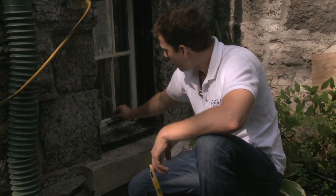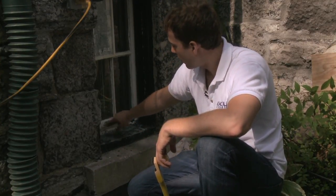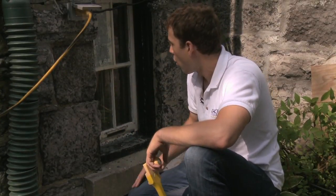The first thing you're going to want to do is take your scraper and scrape away all of the loose and failing paint. Following this, we're going to sand the edges smooth using our electric sanding equipment. We're then going to use a caulking gun and some caulking to seal all the cracks and loose joints. Any loose joints or cracking putty in between the window and the window pane we're going to fill with what's called window putty — it's what holds the glass pane to the actual frame. Caulking is what we use to seal any cracks that connect two different substrates, like wood to wood, or wood to brick, so that dirt, moisture, and loose debris don't get into those substrates over time.